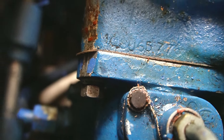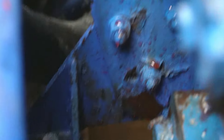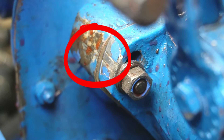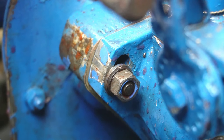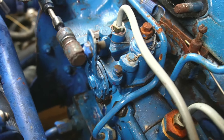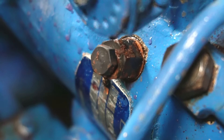There are three mounting bolts. On mine, the upper corner is a hex head socket screw, and the other two are half-inch bolts. You'll also want to make what's called a match mark on the body of the pump and engine. This mark allows you to put it back exactly where it was when you took it off. Misalignment of the pump can cause your engine to perform worse, so please do not skip this step. I also want to point out this air bleeder screw located on the side of the pump — we'll need this when the pump is back on the engine.